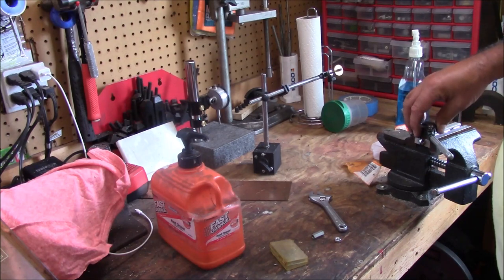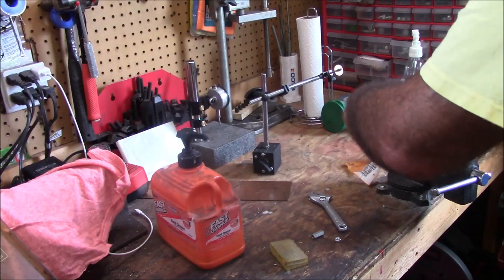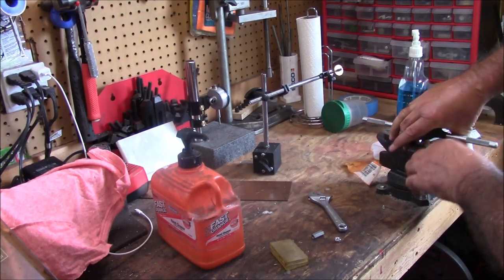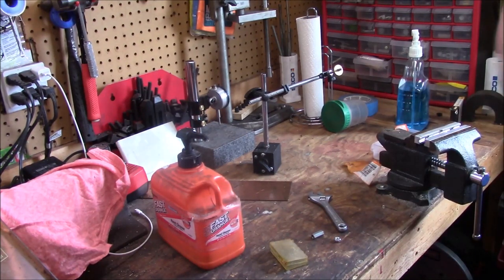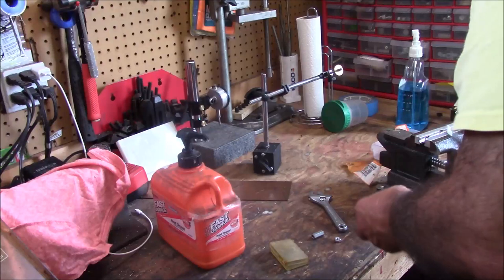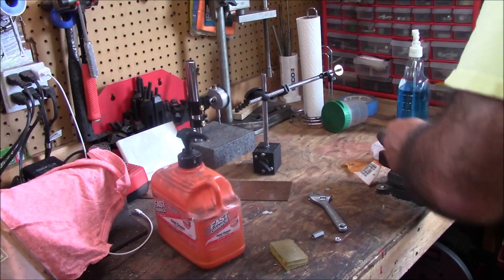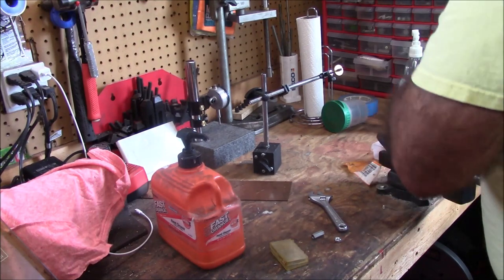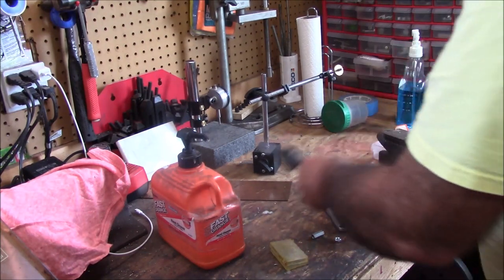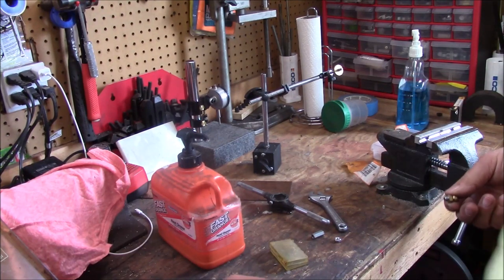What I want to do is drill the bolt on the lathe and thread the grease fittings into the end of it. So I got to looking just a minute ago and discovered, much to my surprise, that's not ideal but it'll work. The threads are not an eighth-inch pipe — they're smaller than an eighth-inch pipe.